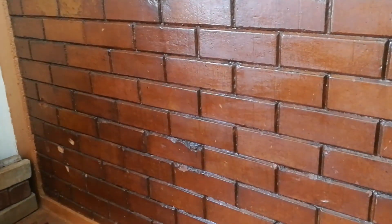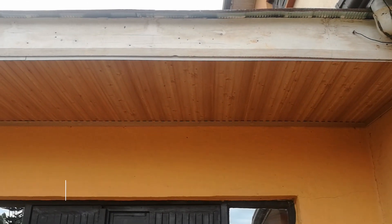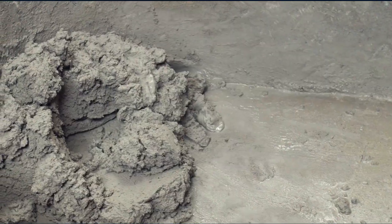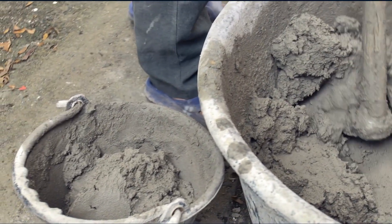The first thing is to apply an oil-based varnish to the blocks — the oil-based varnish prevents water from seeping in because oil and water don't mix. Second, you can make your roof overlap your wall to create an eave, which will prevent rainwater from splashing into the blocks and damaging them over time. Third, you can opt to plaster your walls, which is possible but comes at a cost. I'm doing more research on this aspect of waterproofing and will share it once I learn more.